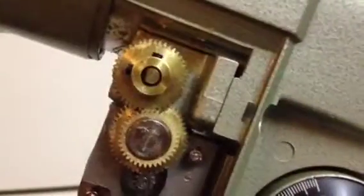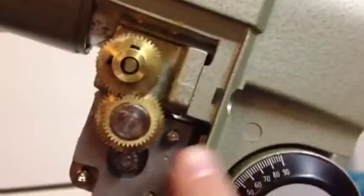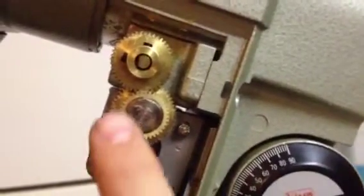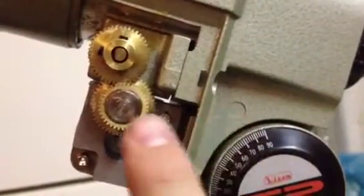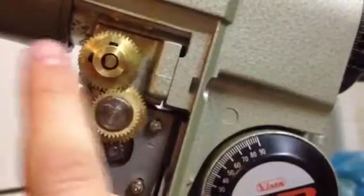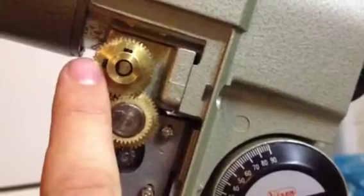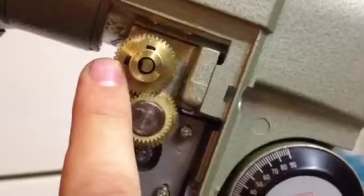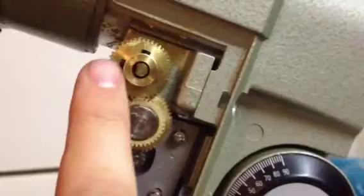Okay, I've now got those at 90 degrees, and I've tightened up the bolt that holds the secondary gear in place and holds the entire RA motor housing on. And now I'll tighten up these little lock nuts to keep it secure on that axle. I found on the original motor, after some 20 years, that some did manage to loosen off. I thought that my motor had actually died prematurely, but I got another 2 years just by checking that these were in place.